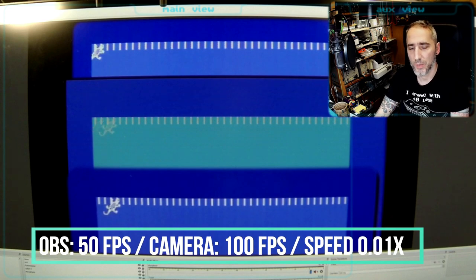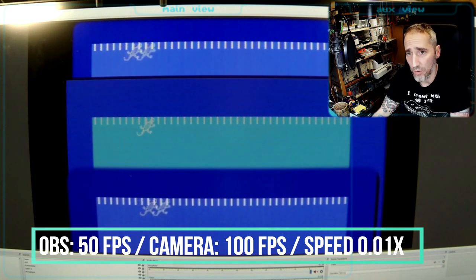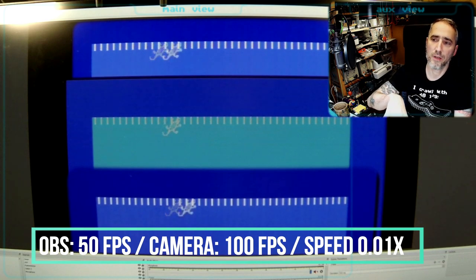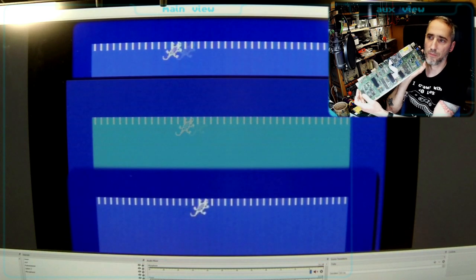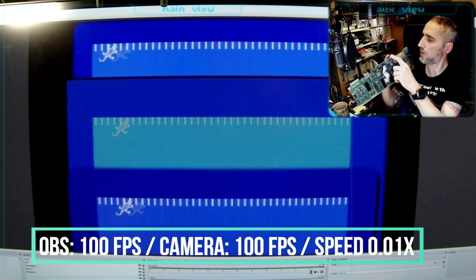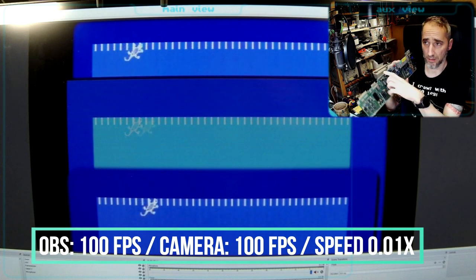What I have done is I have a capture card in my PC with four HDMI inputs, and therefore I'm capable of processing up to four HDMI video signals at the very same time. And here I created an overlay of the video signals coming from this component modded C64 board, this one I have presented, because here I have access to the component signal, to the composite signal, as well as to the YC signal.